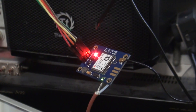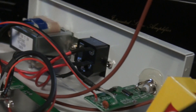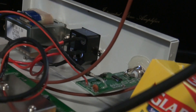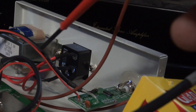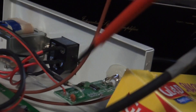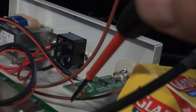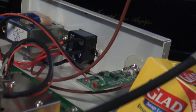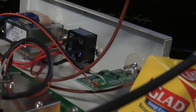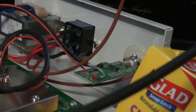A little bit more information. The board has got a red LED that just tells you it's got power — 5 volts. On the back of this counter there's a little board which comes out to a BNC on the back. As far as I can tell it's just a 13 MHz output from the original timebase. There's a red wire going to that board with 5 volts, so if you wanted to put this GPS inside the counter you could just power it from that 5 volt line and remove that board.